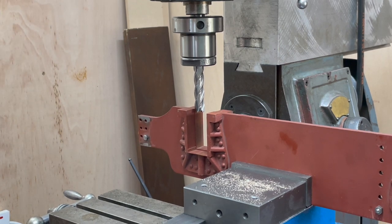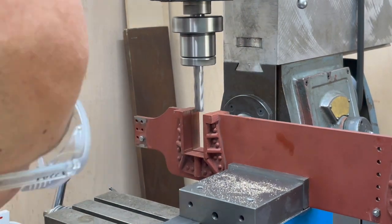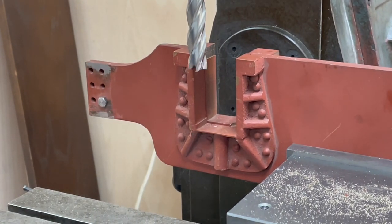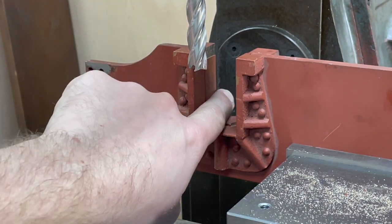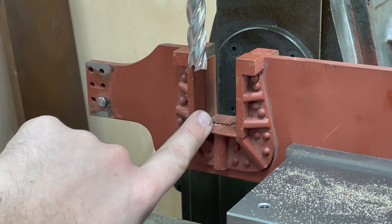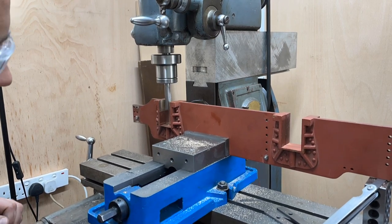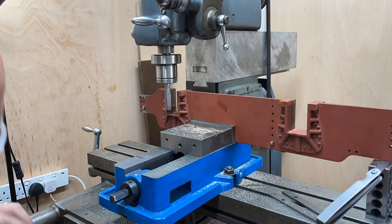I need to just tickle the end of this. I'm going to do that quite a few more times to come down and get these surfaces perfectly flat and coplanar with each other — lots of spring passes, so I'm not going to make you suffer through all of that, I'll time-lapse through it. These slots are actually about 20 thou undersized in their current state, and after machining we're going to end up about 20 thou over to get everything nice and square.